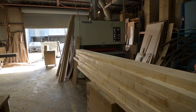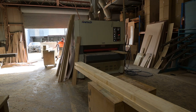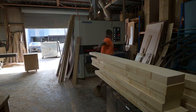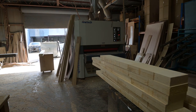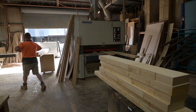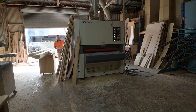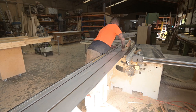Running them through the thicknesser now. This timber came in at 50mm thick and I'm going to machine it down to 48mm — a nice thick front door. Although this is sped up, this feels like how fast I work when doing this. It's a machine where if you dawdle it can take a long time, but if you work fast you can get it done quickly. Just flipping it over and doing the other side, finishing at 48mm — just under two inches — so it's a nice thick door.